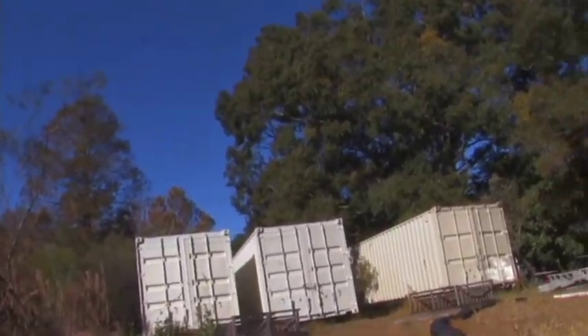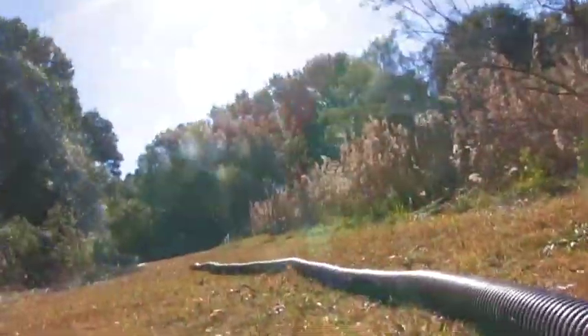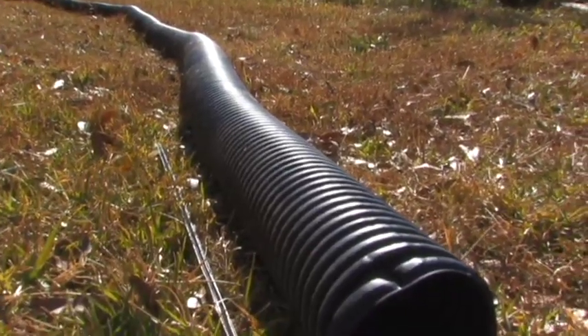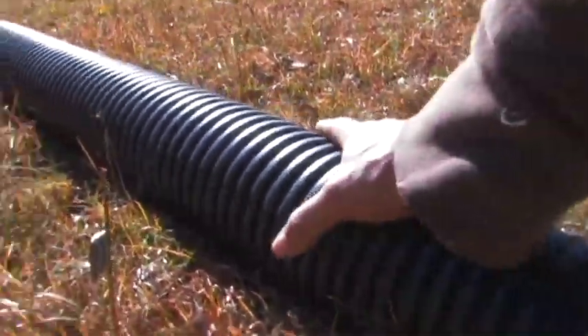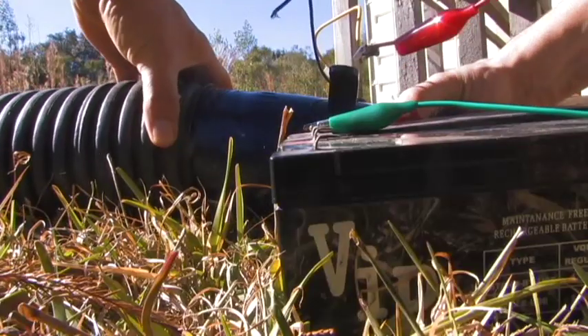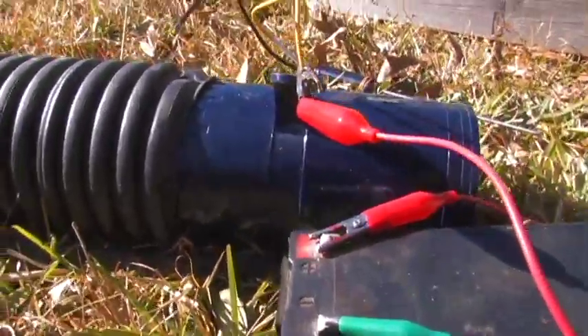It's a good temporary fix. If you're in Florida with a few cold nights a year, you don't necessarily want a giant forced air heater on your roof year-round — doesn't make sense. I have some small 12-volt batteries; of course you need sun. This stuff's been going on probably nine years in the sun. Look at these connectors — you can get this at Lowe's or Home Depot. These pieces just snap together and you can tape them up. The ridges make them flexible and give you added surface area. This fan happens to fit perfectly in there — the 4-inch bilge fans fit perfectly.